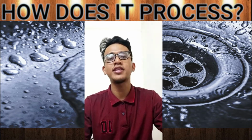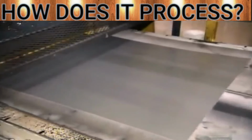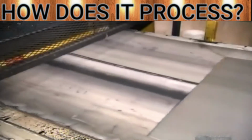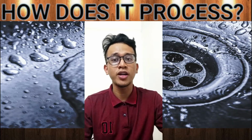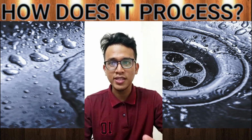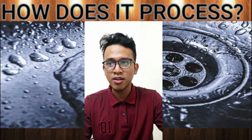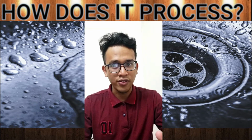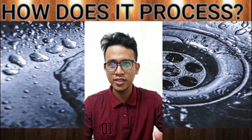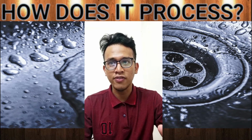Okay, next is material lamination. The ductility of steel plates is limited. In order to prevent the steel plate from being broken or damaged during stretching, it is necessary to coat the steel plates at the initial stage of material. The film is applied only to one side of the steel sheet, and that side of the film will face the mold in the subsequent stretching process. Lamination can be done before or after the cutting.